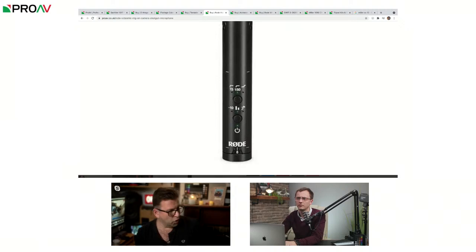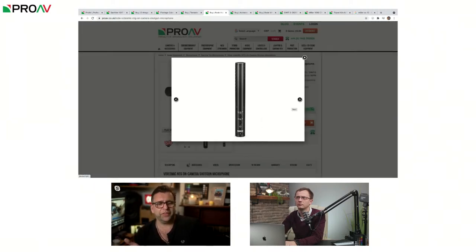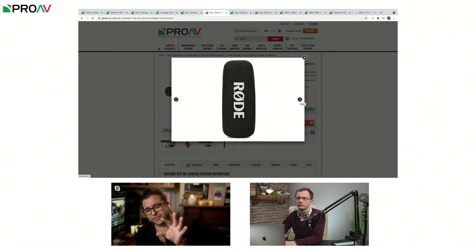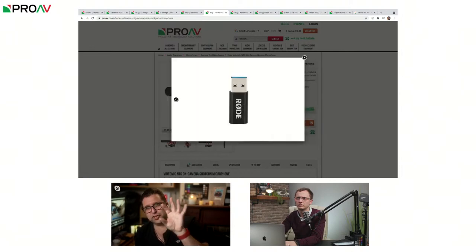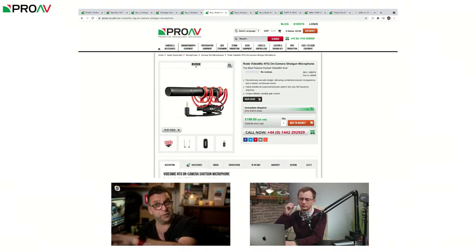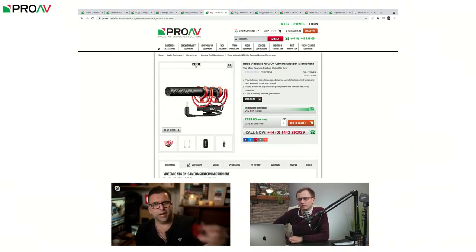And the worst thing about the Sonys, by far, when it comes to audio, there's two of them. For one thing, they still don't have auto levels, which at times can be very useful. For some reason, there's no auto levels. But the worst thing is that when you're just using an internal microphone, you've got to have your level quite high, so like 25, 26. But when you put on even a basic VideoMicro, you've got to bring your levels down to about 6, because it's a very hot input.